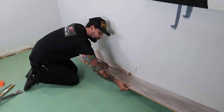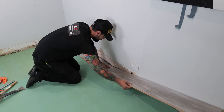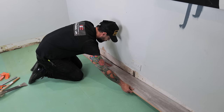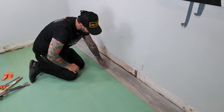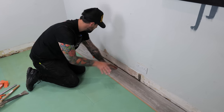Pick your flooring up at an angle, slide it into the clip, line the two edges up and take your time because the first couple of rows are always the most difficult. Lay it flat, make sure you've got a nice join all the way through and that it's not twisted off to one side.